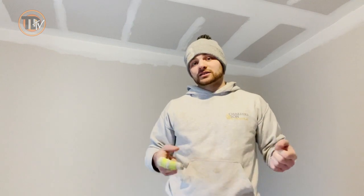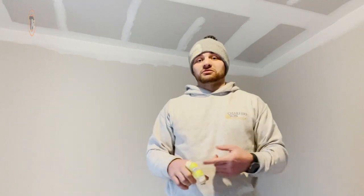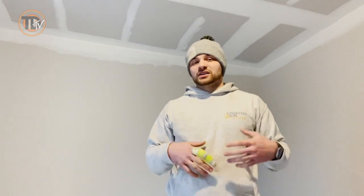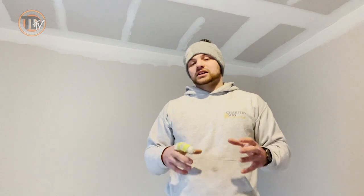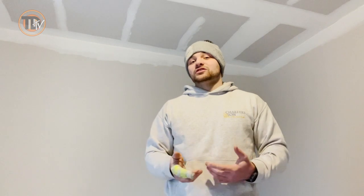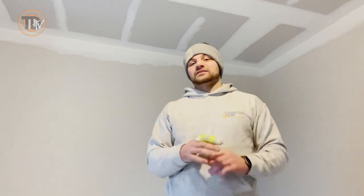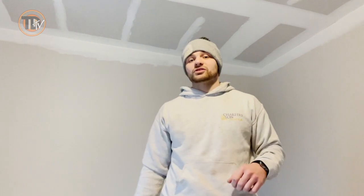Spray plastering: quick mix and straight through the Graco Mark 5 that I had. Spray plastered a small panel - brilliant, really nice. Didn't leave horrible tails either, might be the tip I was using, but it just sprayed really good. Trowelled really nicely. Didn't have any grit in it - sometimes spray plaster can have little gritty bits, but it was really smooth, really buttery, and it was really great to use. It actually sanded really well and didn't leave that horrible dusty residue. Big bonus for me - didn't have to brush the wall down, which we usually do.